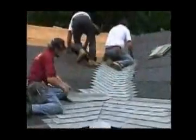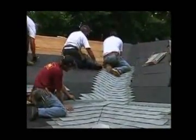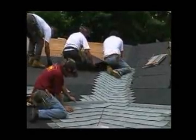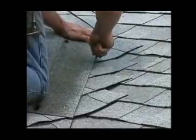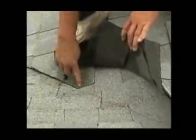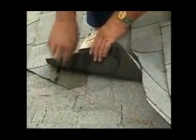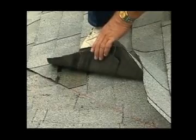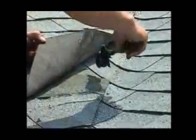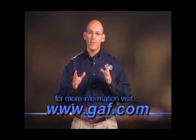Next, apply shingles to the unshingled side. Make sure that the shingles extend past the center line of the valley so that they can be trimmed properly in the next step. Trim the shingles as you install them using a chalk line to ensure a neat installation. Crop 1 inch on a 45-degree angle from the upper corner of each end shingle as you install. This will direct any water back into the valley. Finally, embed each end shingle in a strip of asphalt plastic roofing cement 3 inches wide. For more details on specialized valleys like the California Valley, see the GAF-ELK website.